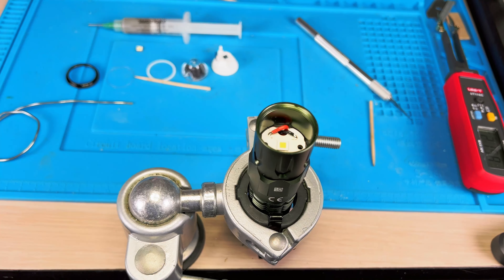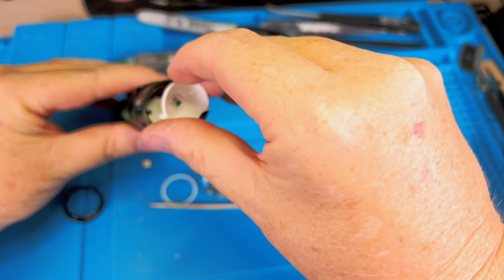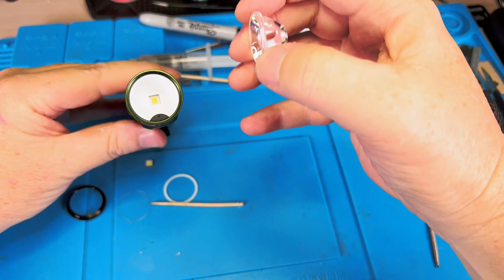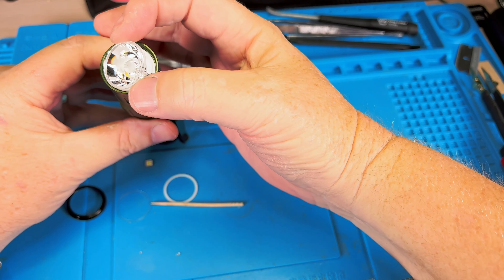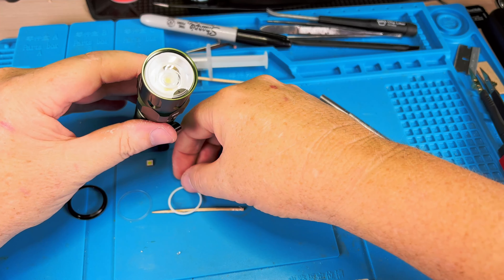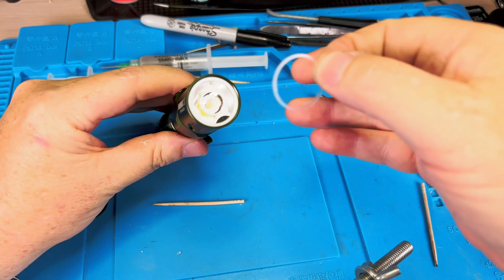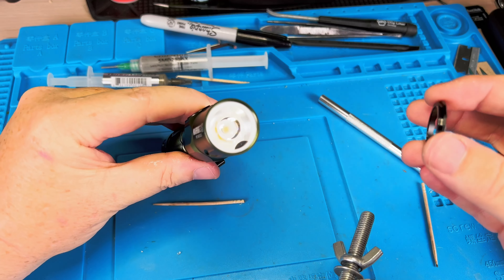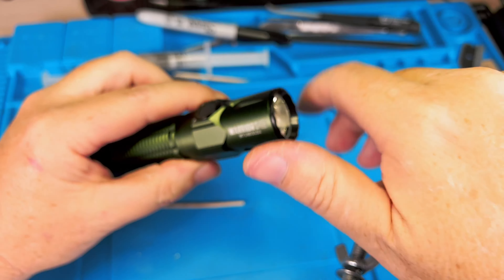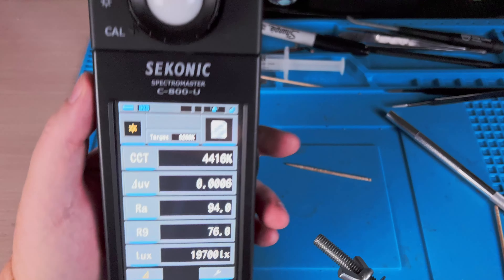Now throw the MCPCB back into the light and reattach the leads — red to positive and black to negative. This is a very easy job; it took maybe 10 minutes. Then reassemble the parts in reverse order: the white reflector first, making sure that long black post goes down the hole where the optical sensor is. Then put the TIR in, then the little rubber O-ring on top of that TIR, then the hard plastic clear ring on top of that. Lastly, grab that steel bezel and turn it clockwise — you can do it finger tight, or grab the strap wrenches and crank it.